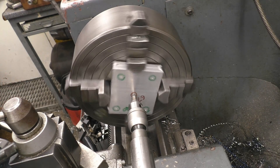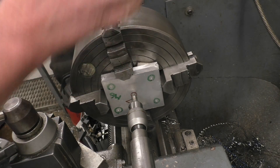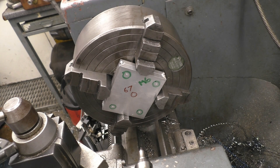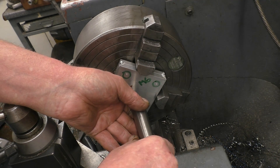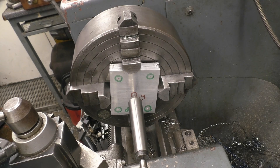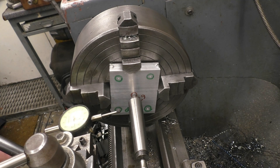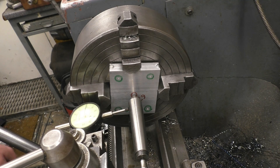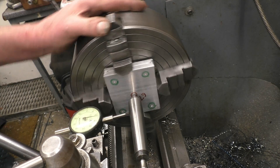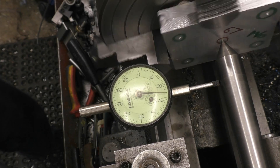I'm not going to run fast, and there's no way those magnets are going to come out of there. Straight away it's going to be fairly well lined up. Right, I'll take it out of there, put another centre in, run a clock gauge on it — that's going to show how accurate we've managed to get it. The closer to the chuck you can get, the more accurate you are. Right, I'll bring the camera around so you can see — that's within probably six or seven thou. So we'll just find the high spot, which is that one, and put a little nip on it.